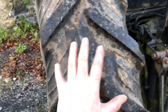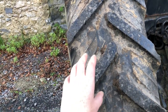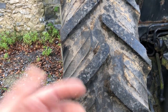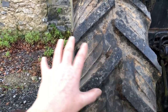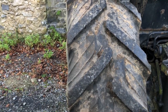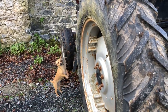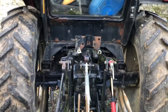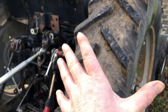Hopefully they'll have a wider surface area, because the narrower the surface area, the more damage is done to the soil. When you have wider tires there's less damage because the weight is spread over a greater area. It's kind of like polar bears' feet — their feet are huge so they can go across ice. It's the same theory with going across soil.